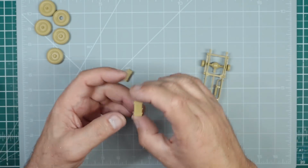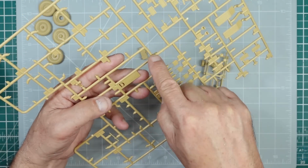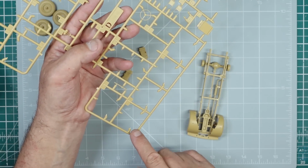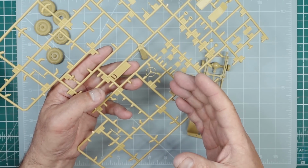And what happens is the plastic is injected. So as you can see on here with this sprue, the plastic is injected in there, and it has to rush out, and go out to all those parts. And by the time it gets to here, or here, the plastic is a lot cooler than it was there, so it becomes harder to inject.